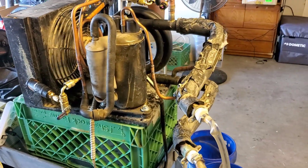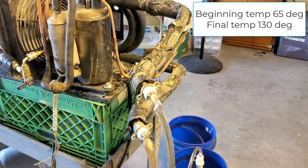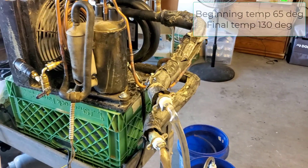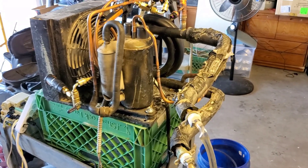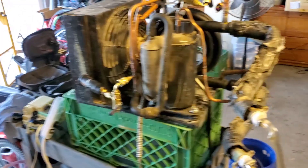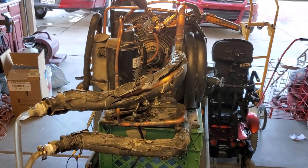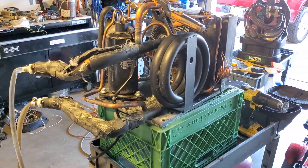Pretty good. Put on screen what the actual temperature rise was because I don't have to look at the video to remember — that's how much it rose within 25 minutes. I don't know how many BTUs I'm actually going to get out of this thing and how fast it's going to heat the water, but it will heat the water. It's real quiet. I forgot to take the amps at the final end there — it's over 500 psi, but I'm sure it was still under 8 amps at 115 volt, which would be less than 4 equivalent at 230. So kind of 4 amps compared to almost 20 amps in your element in your water heater.